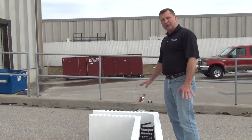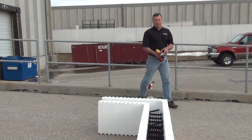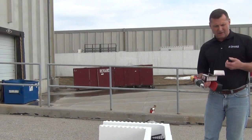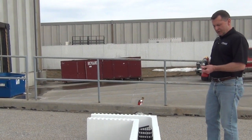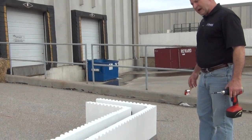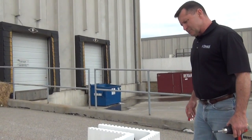I get somebody behind here and start leveling this bottom course up. A standard screw gun and some drywall screws will work — you can use self-tapping screws but it's really not necessary. A standard drywall screw with a sharp point works, and that knurling helps keep the screw from dancing around when you go to get it started, versus a smooth finish, and that's why we have it. I'd set up a transit laser level and start shooting my footings to make sure they're level, and if not, I've got two and a half inches to work with to pick this up if there's little discrepancies in the footings.